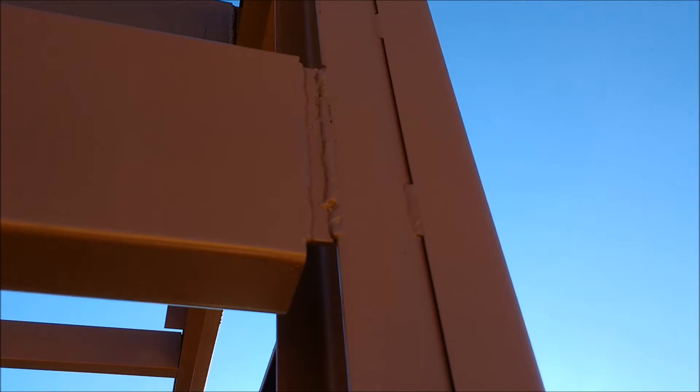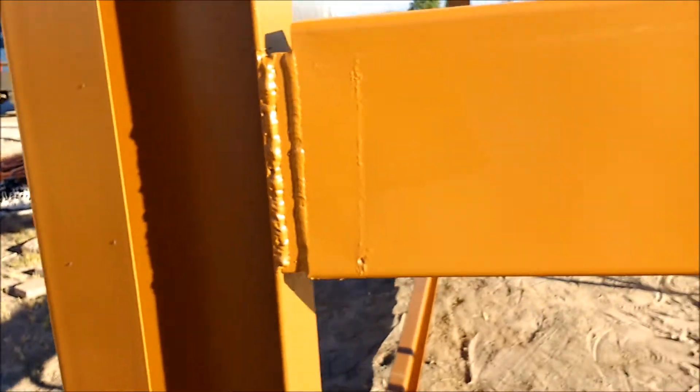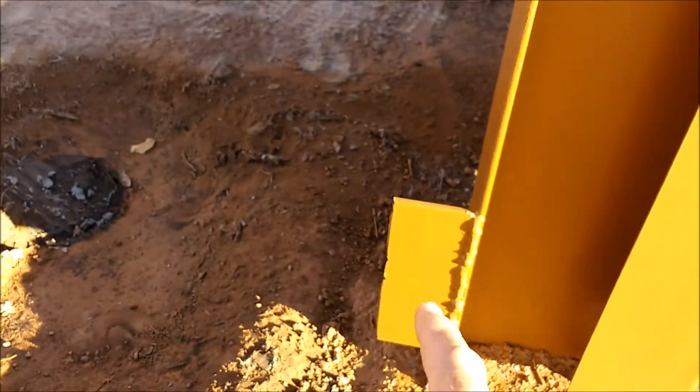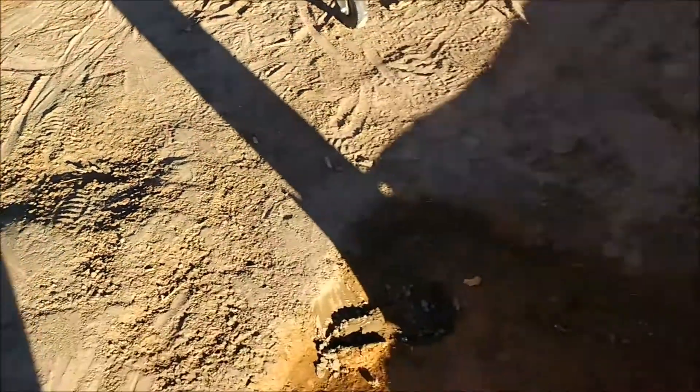The paint dried super quick — about 10 minutes to touch. The color matches the trim on the house and the add-on porch. You can see the MIG welding there — actually some of this is arc welding. The beads look alright, not great but not bad, and they'll hold. Last thing: I ran out of C-purlin, so I've got to get another 20-footer, cut it to fit, grind and weld it on, then paint it by hand since it's just a small piece.